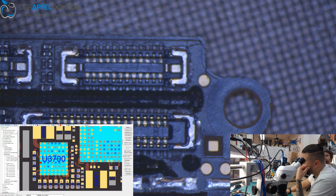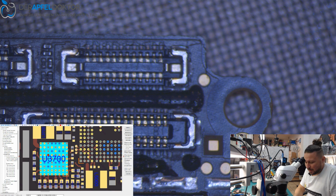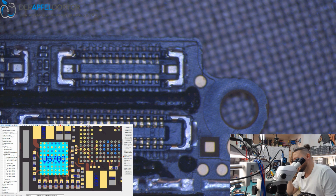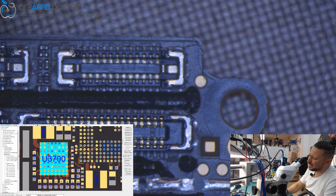Okay. Fair point. That makes sense. I think we have a cold solder on a data line or things like that, and that's the problem why the front and the back camera just don't work. I figured it out last time. I checked the same board. I checked diode mode readings, I checked the voltages, all was okay. I thought, oh, it can't be. I don't want to search, I just swapped the board. Okay, I swapped the board and I got exactly the same problem.